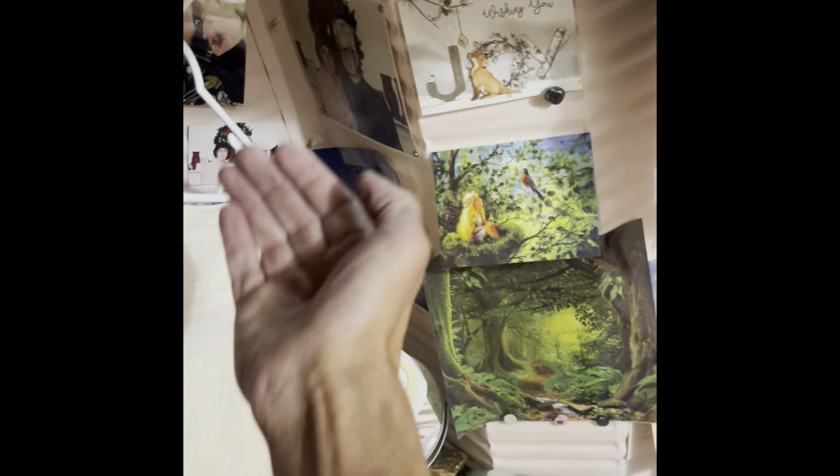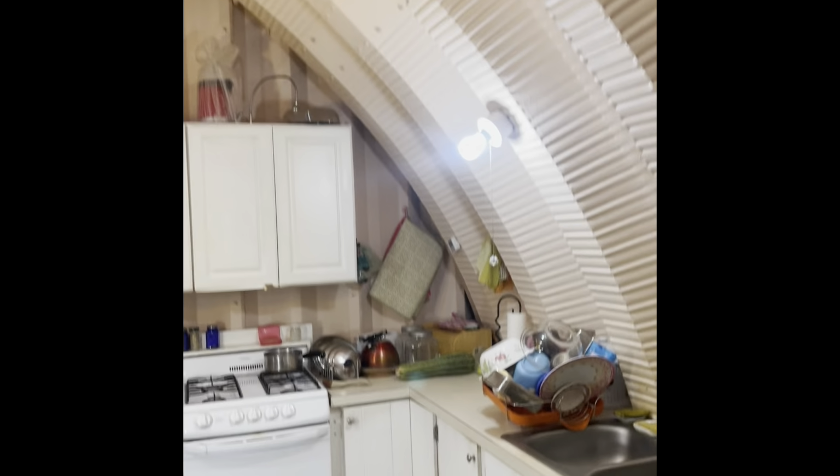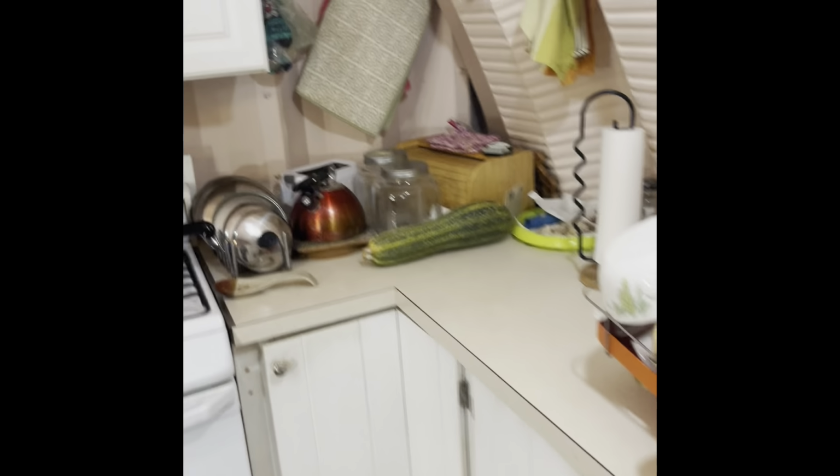You put basically the Quonset hut together, and then you spray foam it, and then you shotcrete the Helix steel mixed into the concrete on there. There's some more ventilation coming up through the back wall in the bedroom. And it makes for a very affordable structure, and it can be done very quickly. In fact, we did one in a rush, and it took only a month by the time I was ready for burying. But I usually wait 30 days before I bury because I want the concrete to cure for at least that long before I bury them.